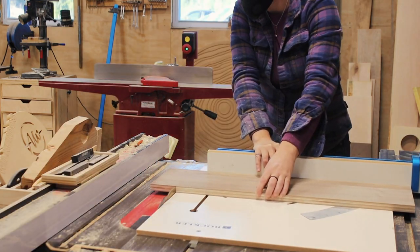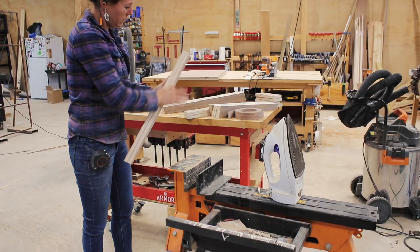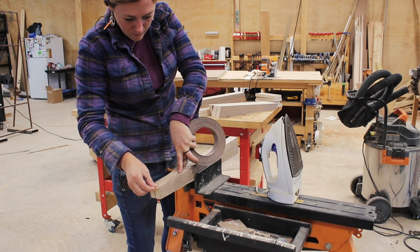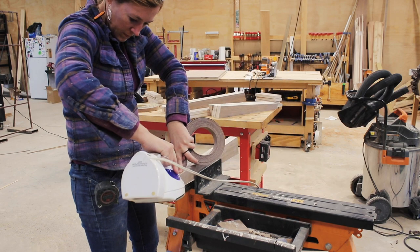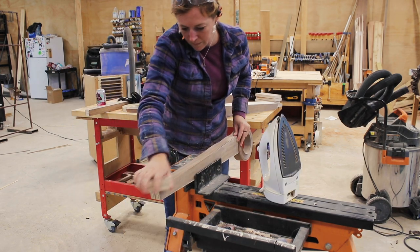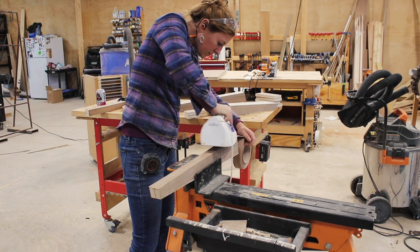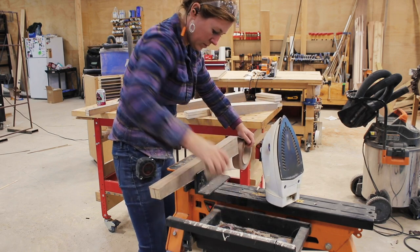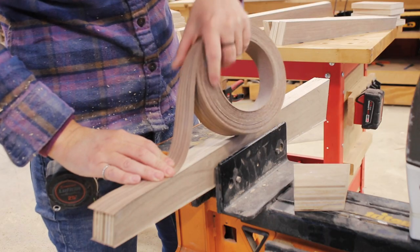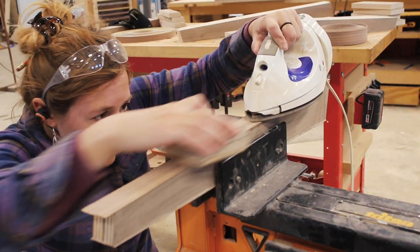With all of the parts now cut out, I started edge banding. Since I'm using walnut plywood I grabbed my walnut veneer — two inch on the legs since they're doubled up, then standard three-quarter on the single pieces. This edge banding will cover up the end grain of the plywood and give it the look of walnut. To apply it I stuck my part in my Triton super jaws then used an iron to heat up the adhesive on the underside, making sure the edge banding was overhanging on both sides giving the edge 100% coverage. You can look at the edges to make sure it all looks good and stuck, then I typically use a scrap piece of wood to apply some pressure after the iron. After repeating that process to all the different parts, the next step was to trim the edges flush with the surface.